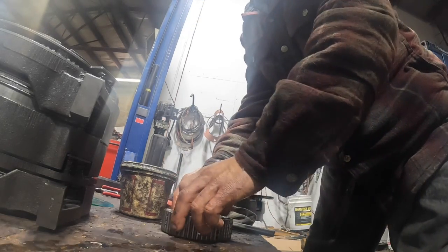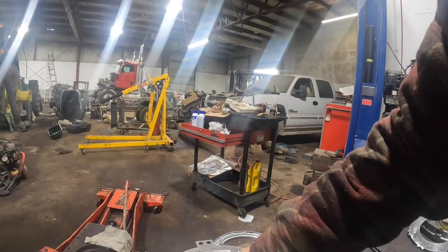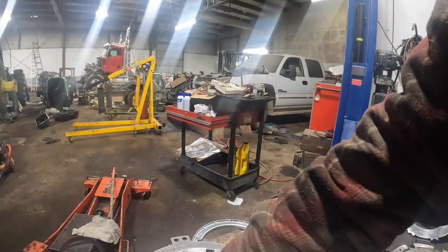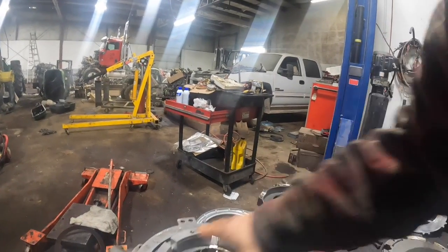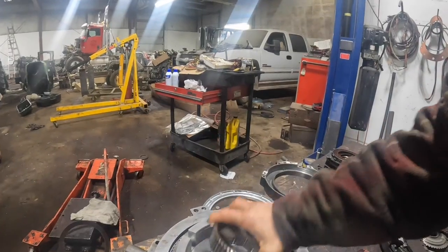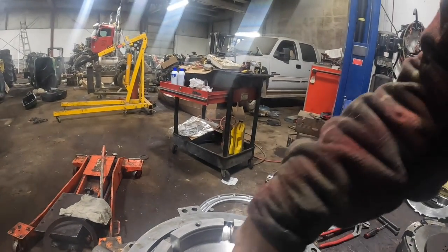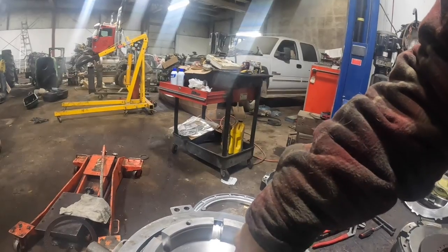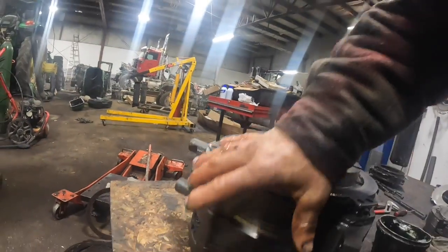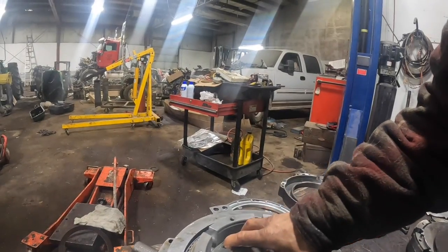Because if everything air checks out okay, we should not be taking anything else apart. And then that hub will go down in here like so. Just like so. And you'll notice that down here as well, you're barely splined into the sun gear on the planetary, this ring gear. It's barely splined up, but once everything's compressed and together, it'll have plenty of tooth contact there.